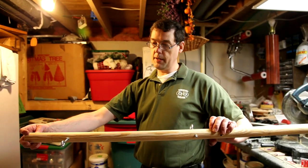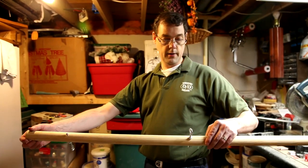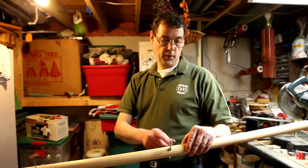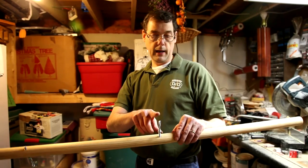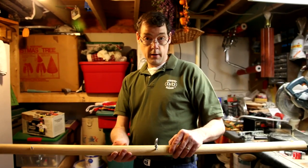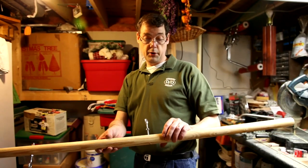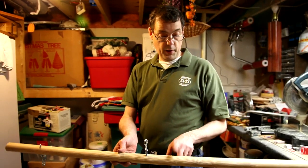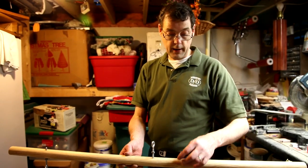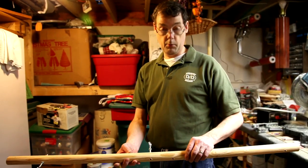The max turn of this will be about 180 degrees, just shy of 180. The longer this rod is — the further this is out — the greater the difference in that half turn. So we'll be able to get a 45-degree angle instead of a 22-degree angle or something like that. And I think if we just take the rope through it as-is, we ought to get about an inch and a half difference, which ought to give you about a 10-degree roll.